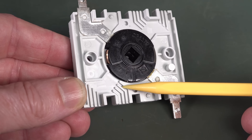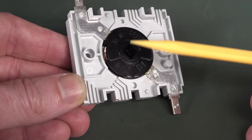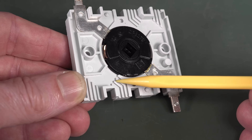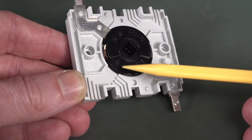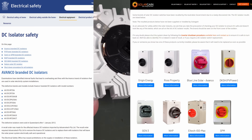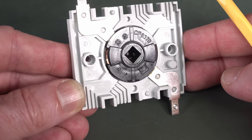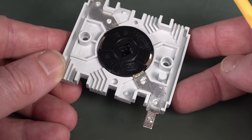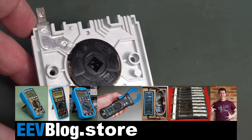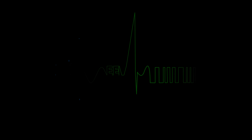Anyway, I hope you found that really interesting. Basically, it's all about the physical design of these arc chutes, arc barriers, and arc traps to actually trap the arc — which is like a high-energy plasma essentially. It just contains that, directs it, and then extinguishes it, because it's got these long paths that it has to go down, so it dissipates all the energy in the arc and hopefully contains it within the switch. As I said, a lot of these things have been recalled over the years here in Australia — let us know if you're aware of recalls in other countries. I don't think this one is subject to the recall, by the way, so this is one of the winner-winner chicken dinners. If you liked that video, please give it a big thumbs up, and as always you can discuss down below and over on the EEVBlog forum. Don't forget to check out the EEVBlog store for all my merch. Catch you next time.